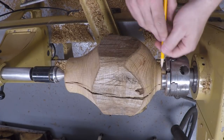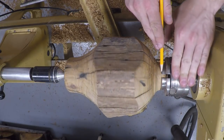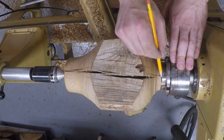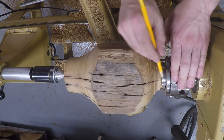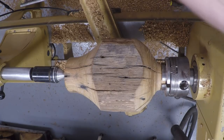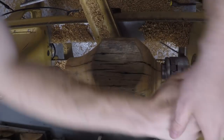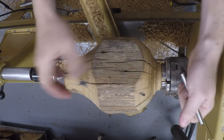I made a little bit of a mistake on my tenon. You can see the gap in between the top of my finger and the base of the tenon. I'm used to cutting tenons from my larger chuck that has a deeper finger on it. Really you want your tenon to seat on the top of your chuck finger versus in the bottom of the pocket like this - there's a chance that the bottom of the pocket isn't exactly even. For this project it's not terribly critical. We just need to be able to drill the hole in it. We'll go ahead and tighten it up and clamp it in, and I've got my tailstock up right now to keep it about where it was before.